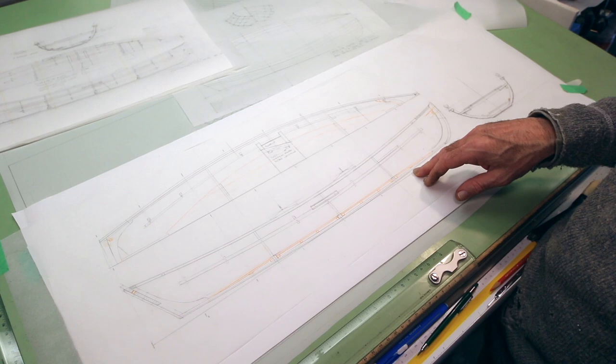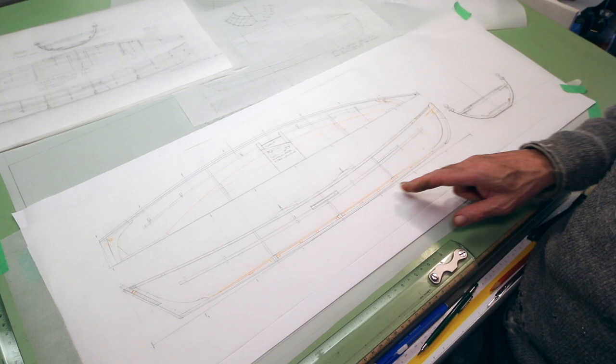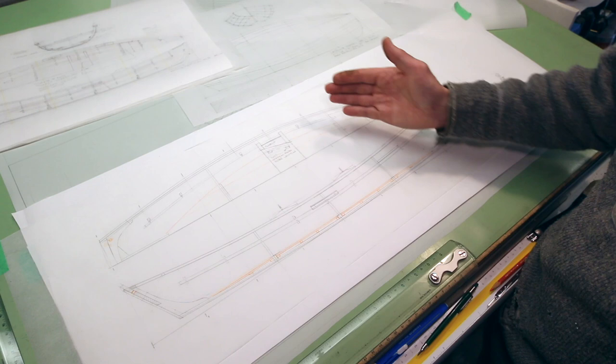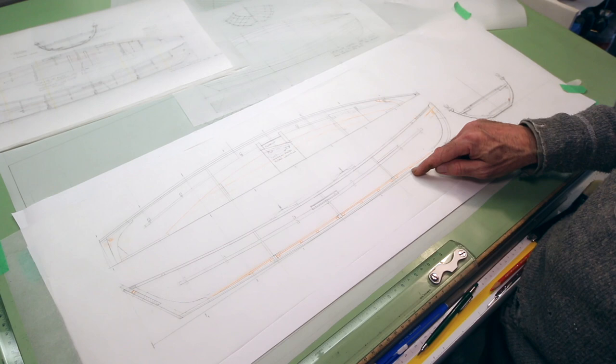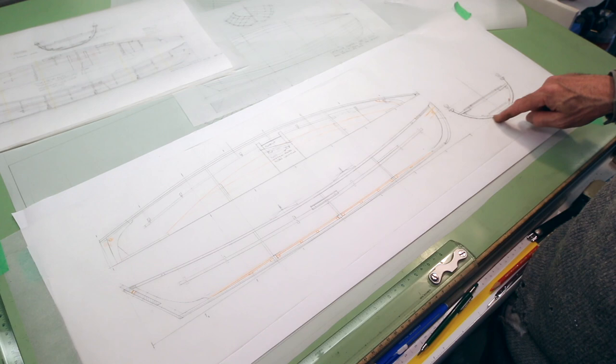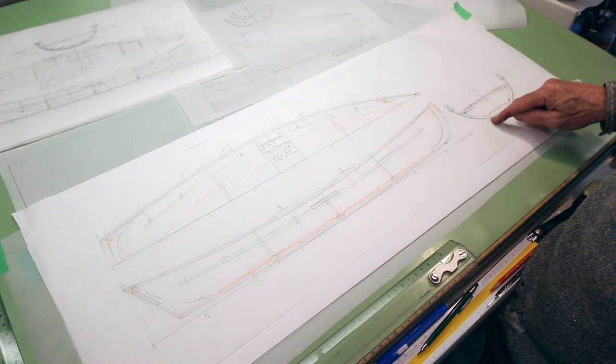And if it were fiberglass, for instance, yeah, you could build up the fiberglass, but you're always worried about when that thing finally wears through someplace and then the water is getting into the core of your bottom, which is going to be plywood. So we'll be eliminating that problem. In fact, we'll probably glass over the garboards and bottom in one piece, just like I did to the Bushidori. And that's mostly to put glass onto the garboards themselves. But if I'm glassing that, I might as well carry it right the way across.